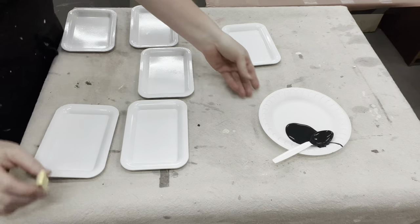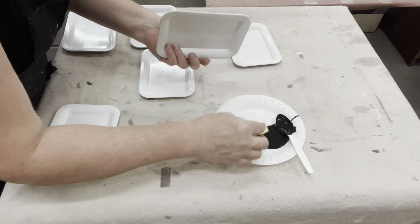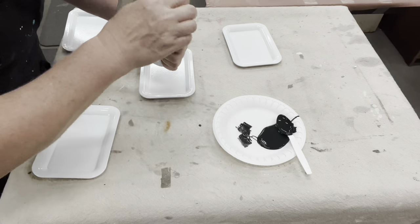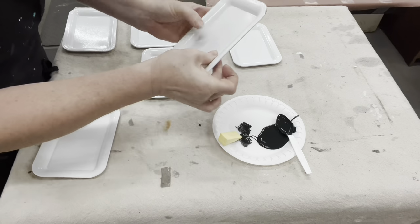The one thing I do notice with this Farm Implement paint is it takes a lot longer to dry. So it took 2 days to do this one side. I sprayed once and let it dry overnight. The second side I sprayed and then let that dry overnight. Now this is into the third day and now I can paint on my line.